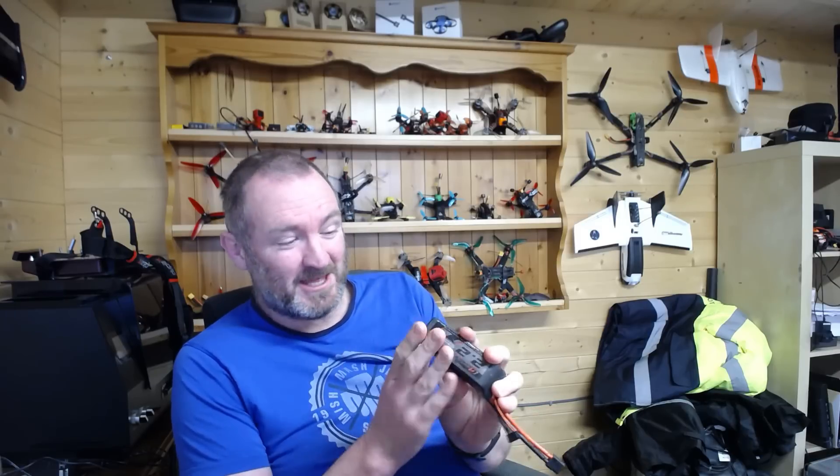Storage charging — why do we storage charge? Quite simply, LiPos have a hell of a lot of energy. The problem is when you pump these things full of energy, they hold that energy well, but if you leave them fully charged, things gradually begin to go wrong. You won't notice it on day one, but over a period of time the effectiveness of your LiPo just kind of deteriorates. You go from having a LiPo which will deliver everything you want, and then because you've been leaving it fully charged, it gradually gets worse and the chemical reactions just don't play well.